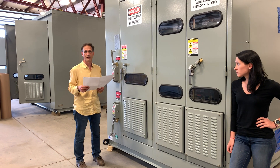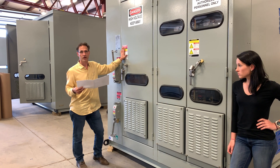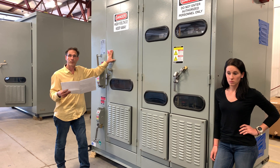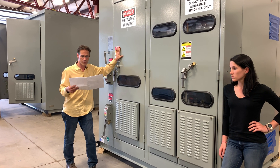Hello everyone. My name is Paul Stetschik. I'm with Northeast Power Systems. I'm standing in front of a 1800 KVAR three-stage harmonic filter bank. This is a one-two-three sequence to it. It's 4.7th tuned and it's destined to a gas plant in West Texas.